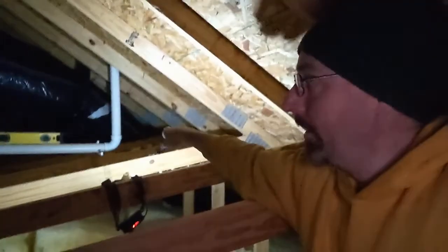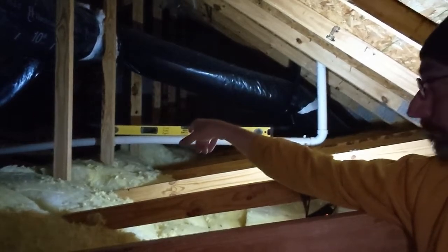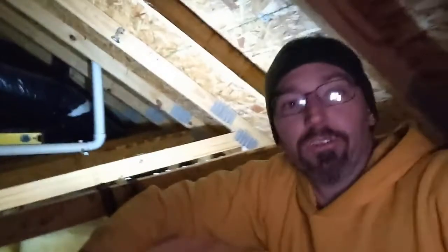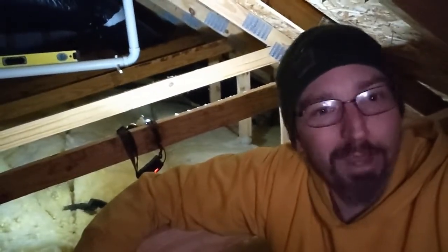And now that we've got this pipe braced up and secure where it needs to be on this end, I also raised the support J-hook that was in the center, so it's supported there. And there's enough flex in the rest of the system. It should be good. Now we can go outside, get up on the roof, take care of the pipe collars, and finish solving the rest of these problems for her.